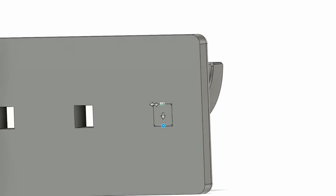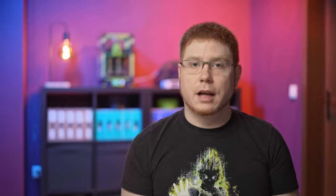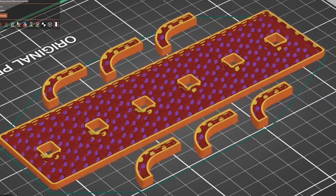Since 3D printers can't do sharp 90 degree turns, there's always a bit of rounding in the printed part. Another advantage of this approach is that we can now print the base with its front lying flat on the print bed, which always looks great if you have a textured build plate. Ideally, you set the hook dimensions for a perfect press fit into the base holes, but that involves either precise knowledge of your printer's tolerances or some trial and error prints. There's also nothing wrong with a bit of post-processing using sandpaper. I personally would make the hooks a tad bit smaller and fit them in place using super glue — the glue only prevents the hooks from falling out of the hole and doesn't have to bear any load. If you like design challenges, you could also add a recess to the base hole and a flex clip to the hooks to make them snap in place. In any case, you'll end up with a really sturdy and long-lasting design.